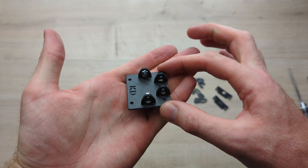Now let's move on to the top plate. You can see the same design here with the countersunk holes and the slots on this side. We're going to do the exact same thing as the bottom plate, but opposite — so the larger hole ones are going to go at the back and the smaller hole ones at the front. This time we're going to use the M3 by 8 countersunk screws and the 2mm driver to secure those in place. Now we've got all of those installed on the top plate, we're going to do the same thing with the press nuts on the back. Now the top plate is finished as well — nice and flush on there.